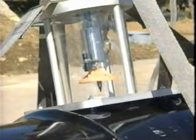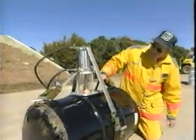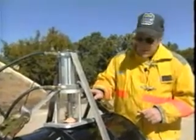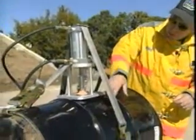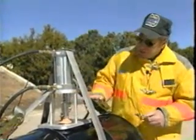At Los Alamos, we've developed the remote container sampling device. This device is used to vent bulging or pressurized drums. It's a pneumatically operated device, has a cable and air hoses that extend 150 feet away from the bulging drum. The ram pokes a hole through the barrel. The seal then seals the material inside the barrel, and the pressure can be vented through a plastic line to the sample bag or to another container.